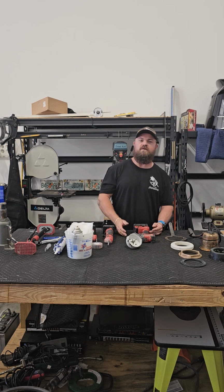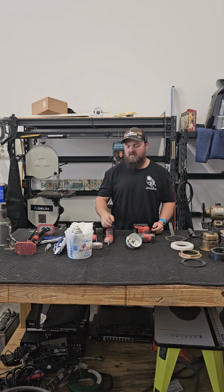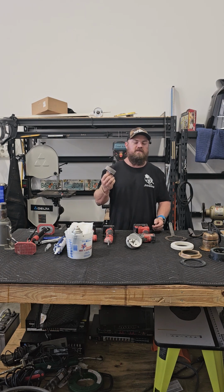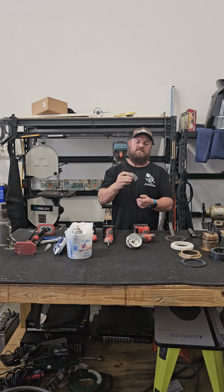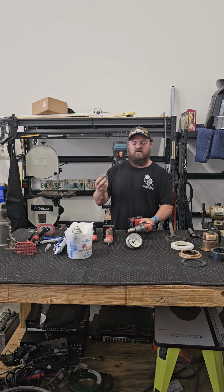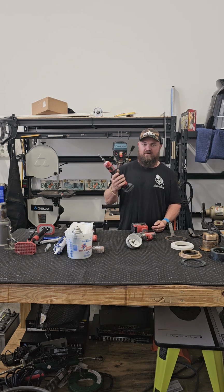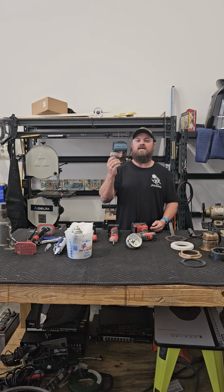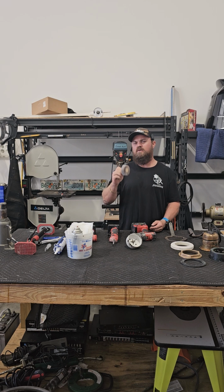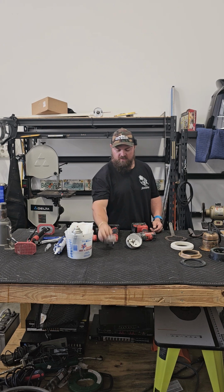After you've drilled the hole, if you don't drill it exactly straight, sometimes the transducer doesn't want to go in. So you have a couple different options. You can use a whiz wheel like this, which is just a wheel with little bits of sandpaper that you can stick in your drill to enlarge the hole, or you can use a 1/4 inch die grinder with a carbide bit on it. This works a little faster. This works just as well, and actually this is probably the better tool as it'll leave a smoother surface. It doesn't gouge in and bite and possibly go further than you want it to go.